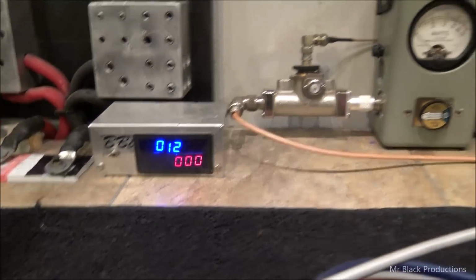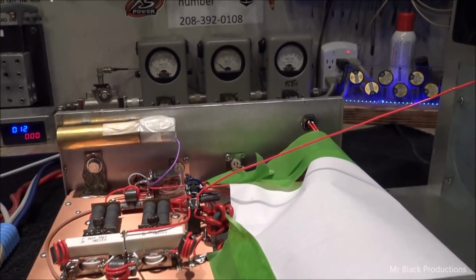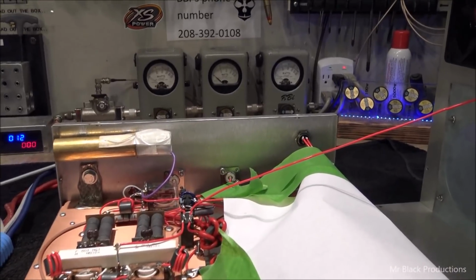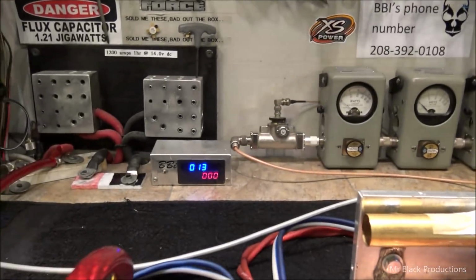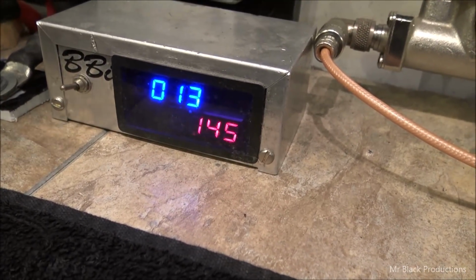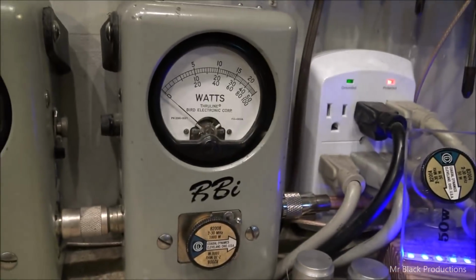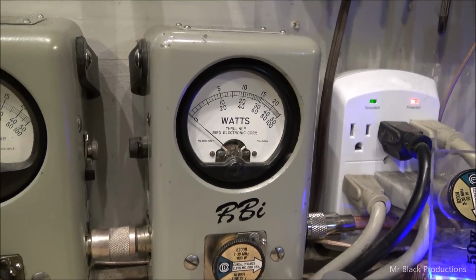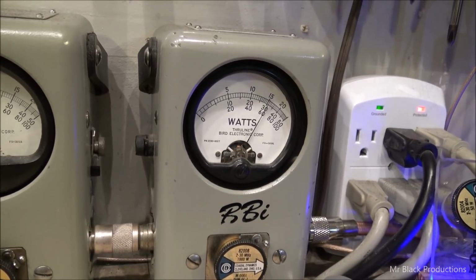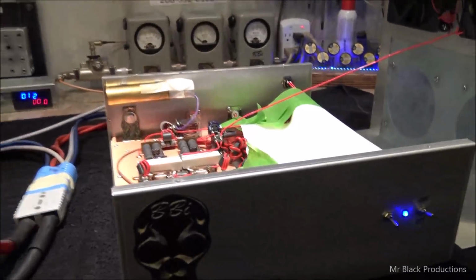Now to get this equivalent amount of power in a 2879 box, you're going to need 8 transistors, which is going to pull about 210 amps. Well, as the voltage goes down that's feeding this box, meaning the devices that switch in this thing have to work a little bit harder, it pulls more amperage. So we picked up 22 amps worth of draw, and our output power has dropped significantly. Lost about 280 watts of output power.